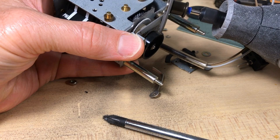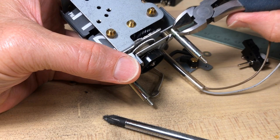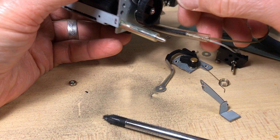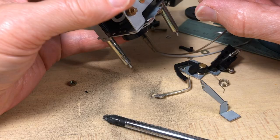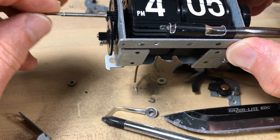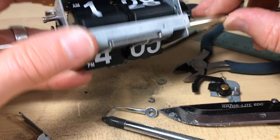I'm trying not to leave scars on this so that when I get this clock built it doesn't look too bad inside the tube. That's what I'm going to do — make an upcycled flip clock with this. I've wanted to do this for years. I'm not going to show the full process; it does take a little while. If you see one on Etsy, whatever they're charging, that's not too much — there's really no way to make money on that. We've got the mechanism down to its bare bones. I'm going to cut this shaft off to fit it inside that tube and put a new knob on it, built out of epoxy putty.